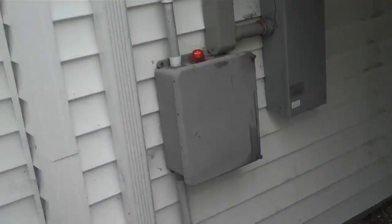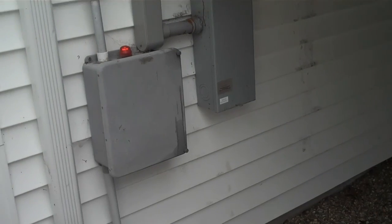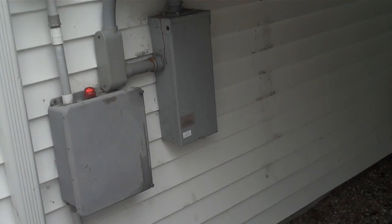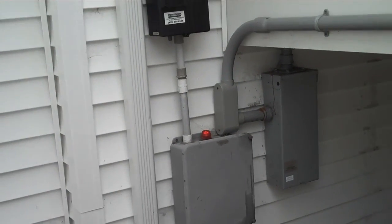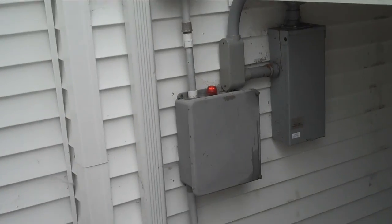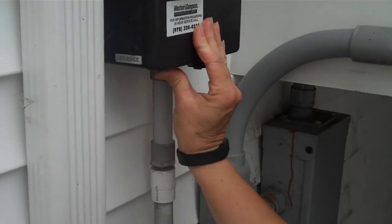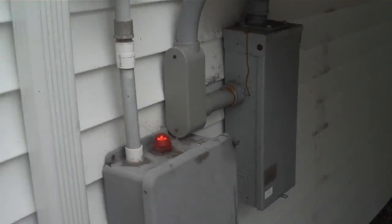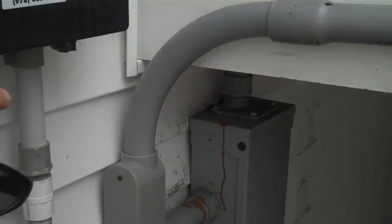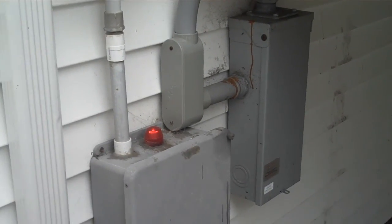This will probably go off in about a minute, because it has to pump all that extra water that we put in and get it below the alarm level — that usually takes about two minutes. If this were an actual emergency and the pump failed, the silence button is right there — go ahead and push it up. There you go. But the light's still on, so you know that there's still an alarm condition. If you don't want to disturb your neighbors, you can silence it and then check for the light. The light is telling you that there's still a high water condition.